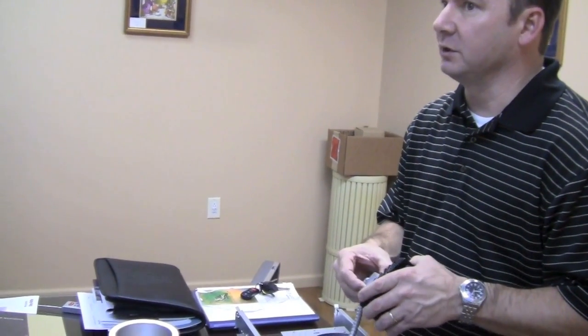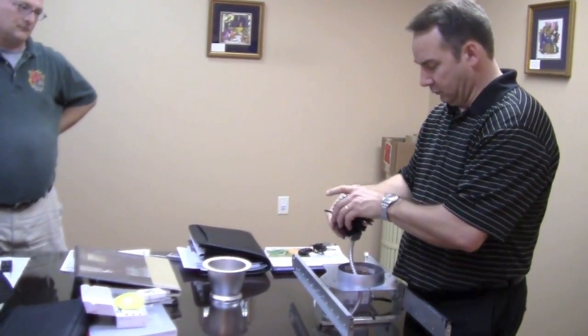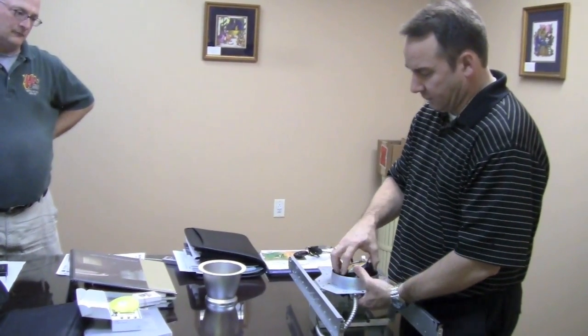That's what our testing shows based on using the chip manufacturer. Have we run it for 50,000 hours? No. Nobody has. Well, I'm just wondering if that's, again, based on tests where 50% of the fixtures or lamps have reached that, or is it an absolute that you will have lost 30% of light output from those LEDs at 50,000 hours, or could it be you still have more light? Using the absolute photometry that we're required to use on the LM79 and the tabular data from the chip manufacturer LM80, the testing and the numbers say that at 50,000 hours it'll be 70%.